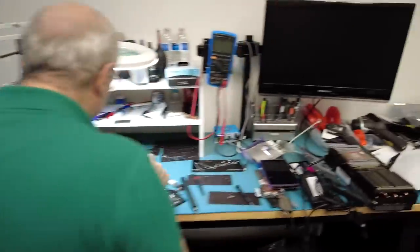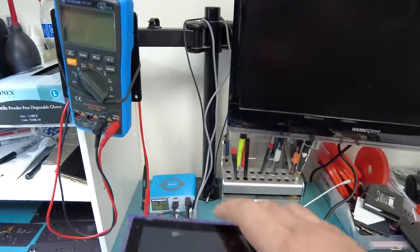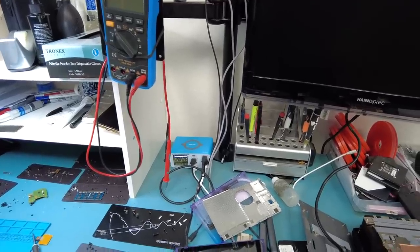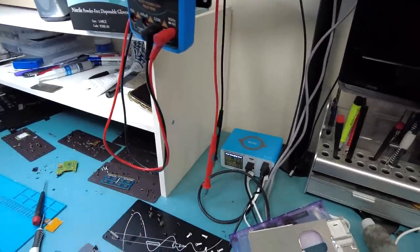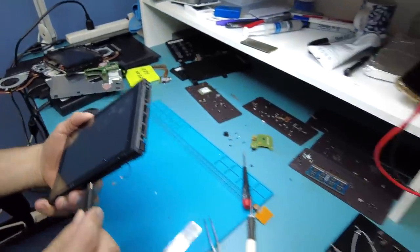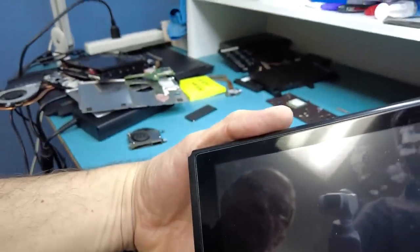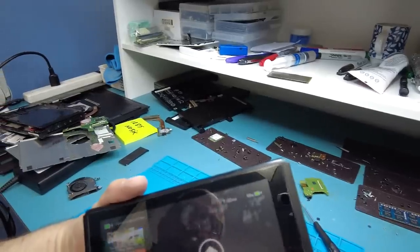Here's what happened. Big Boss reassembled the board onto the customer's purple screen assembly. The console was still charging at 12 volts and would not drop to 9 volts. He swapped in a fresh battery, and it then charged at 9 volts — so the customer's battery is also faulty. When he connected the customer's screen cable, the screen was black with no image. He grabbed our test screen, connected it to the board, and got an image immediately. So to summarize: the customer's screen assembly is faulty, the screen connector was faulty, the MAX21 chip was faulty, and the battery is faulty.